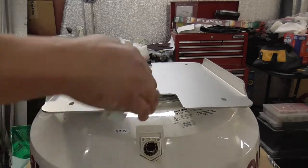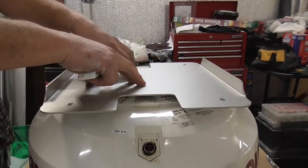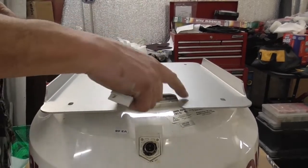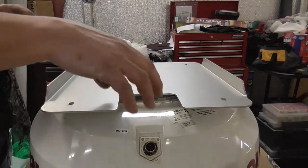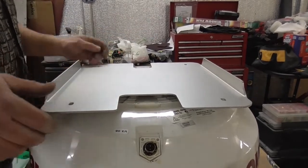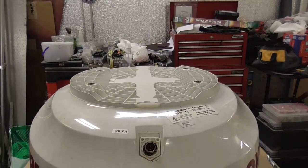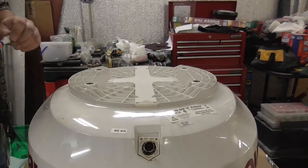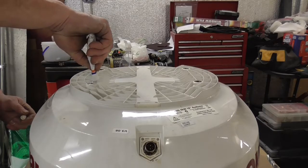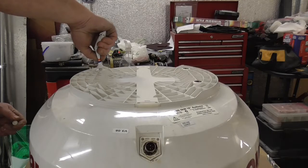So we're at our work table right now. We've got our radar upside down with the rear of the radar pointed towards the camera and the attachment plate for the radar array pointed towards the rear. This is where one of the bars runs in this wide slot, and I want it towards the back because we're going to have to mount a navigation light on this bar. What we're going to do is take something like pipe thread sealant — something you can wipe off that won't hurt the plastic case — and apply it around the mounting holes on the radar array.